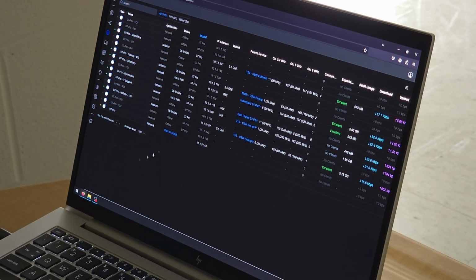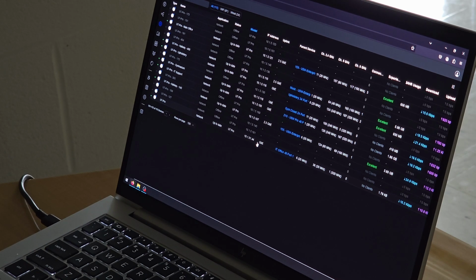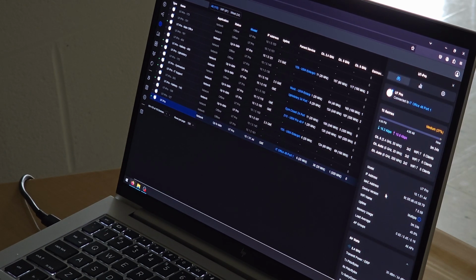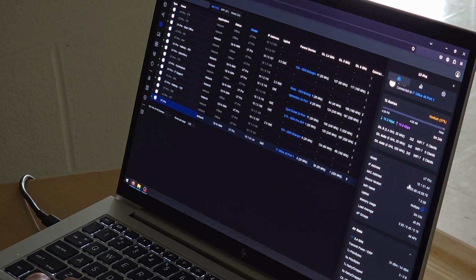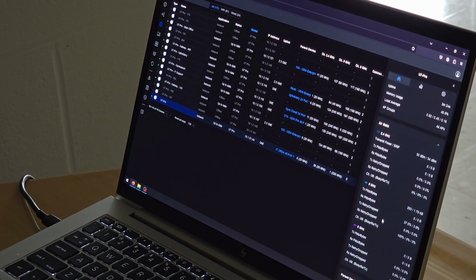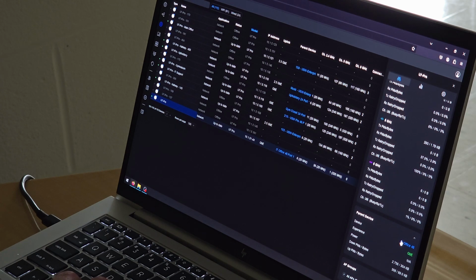So when you plug in the U7 Pro, it will show up in your network console here. You will need to click Adopt. Once the device is adopted, we can click on it and we can see more information about it. One such bit of information is its model name, MAC address, IP address, and so forth. We can see the different radios, 2.4, 5, and 6. See the device it's connected to, any AP groups that it's in.